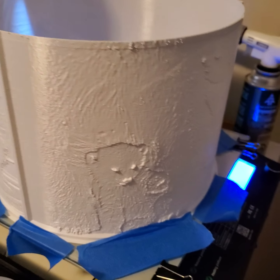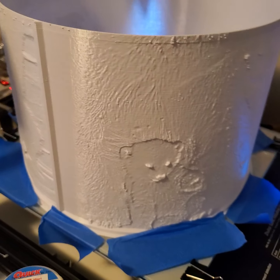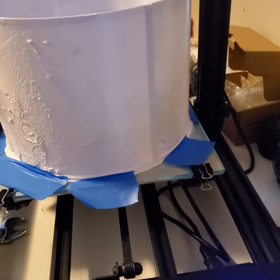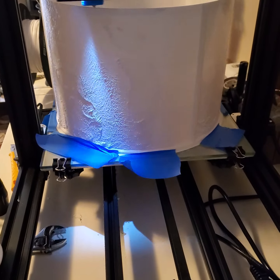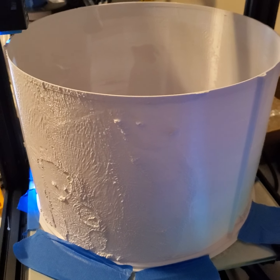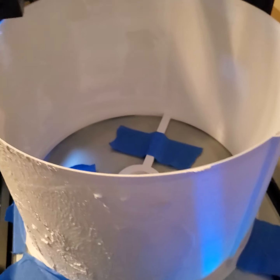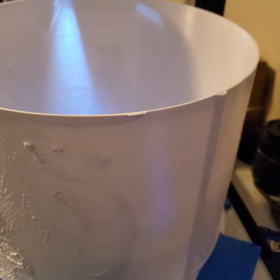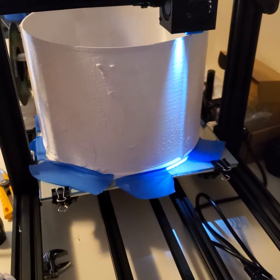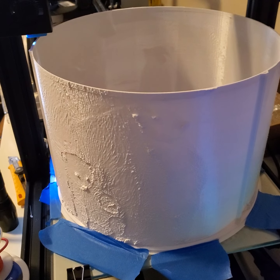It still freezes and stuff, so you notice I'm getting lots of little bumps all of a sudden. So I think either the SD card is messed up, because that's what happened before, or this printer just can't handle this big of files, which is ridiculous because this printer is supposed to handle this. This is only 300 high and it's supposed to handle 400, and it's hollow. So I know it's a big G-code file, but that's what this thing's supposed to be. So I'm a little disappointed. I'm gonna have to do another one with a totally brand new SD card and see what happens.